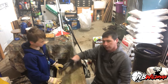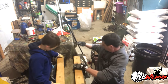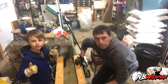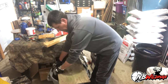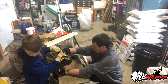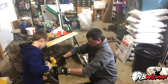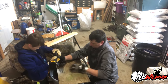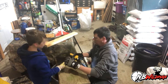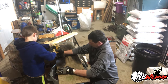So we start out with that two-foot by 13-inch piece of plywood. Then we grab two 2x4s, 24 inches long. What we're going to do is screw those onto the edges of our plywood — put our screws up from the bottom. We're going to put probably four or five on each side since they're short.